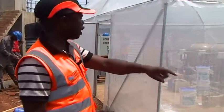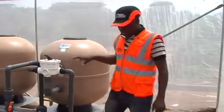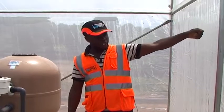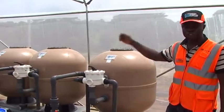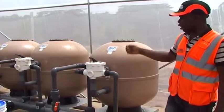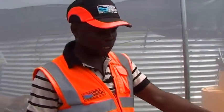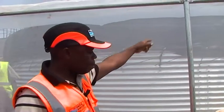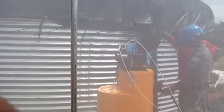From here, directly into our filtration units that will be channeled through. We take the water that has been clarified in the storage tank and feed it into the sand filters for final filtration to get a clear and higher quality water. The filtered water from this system will be stored into the clean water tank, and on the way to the clean water tank, we dose chlorine for disinfection.